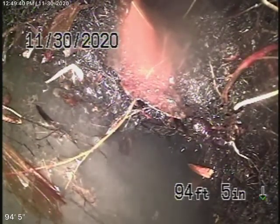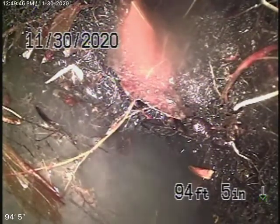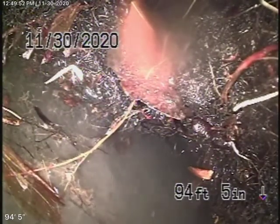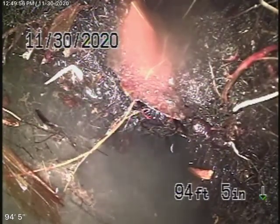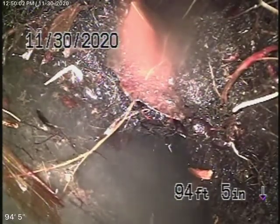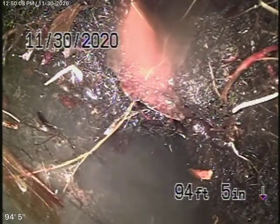The general inspector is going to crawl under the house and do a more thorough inspection of the sewer line. We're running our camera from a clean-out located outside the house. Whatever we saw on the cast iron looked a little rusty — it wouldn't be a bad idea to have an end-of-line clean-out to the outside and run a cable with a blade through the cast iron to descale it as much as possible until it's time to replace the pipe.